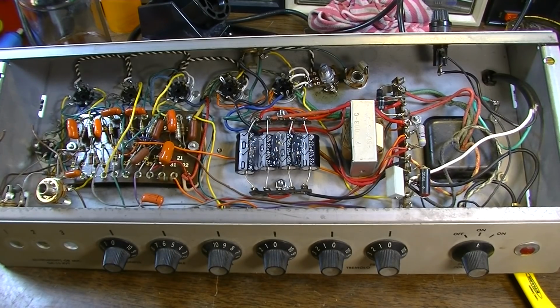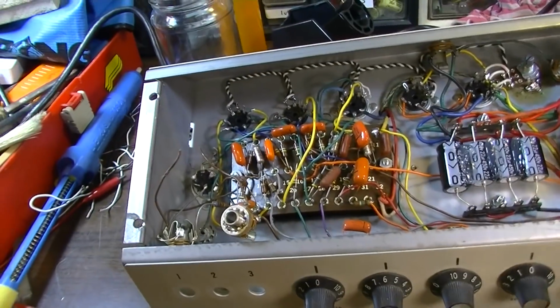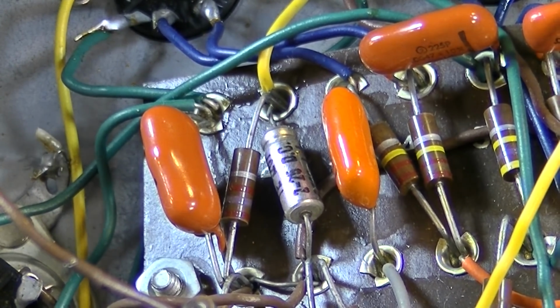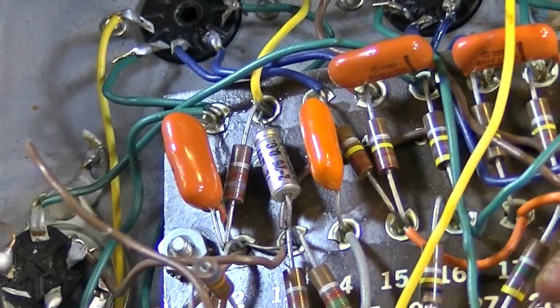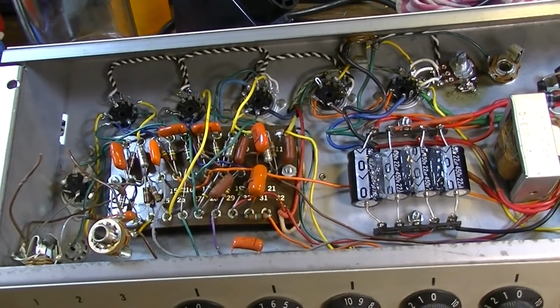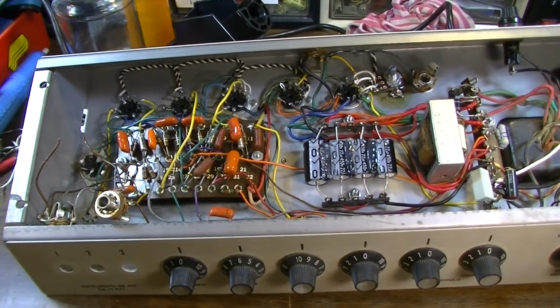I'm looking at a schematic right now, and it's nothing like what I'm seeing in here, and it's for the GA15RVT. The schematic I'm looking at has all kinds of things different, actually. Especially in the tone stack. It looks completely different on the tone stack almost. On the first stage, the schematic shows no bypass capacitor, but there clearly we have that silver bypass capacitor, which is what, 2 microfarads, something like that. So I do think what I'm going to do here is just come through and redesign this preamp. Maybe just redesign most of this amp, period.